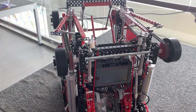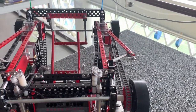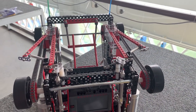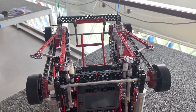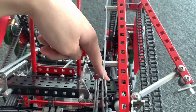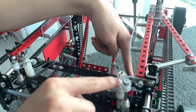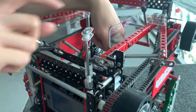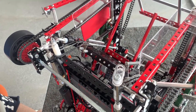Everything is automated by using a task. Probably the more interesting thing on this robot is the band release. In autonomous, we have to shoot from the half court, but we're usually going to shoot pretty close in match play. So basically in autonomous, I'll have a third rubber band — a third latex tubing over here. I chose latex tubing because it unstretches a lot less. I'll have a third rubber band in autonomous to make sure that I will shoot farther with more tension. Once the match starts, I'll simply bring the piston up, and that will just release the rubber band, releasing the tension so I can shoot closely.